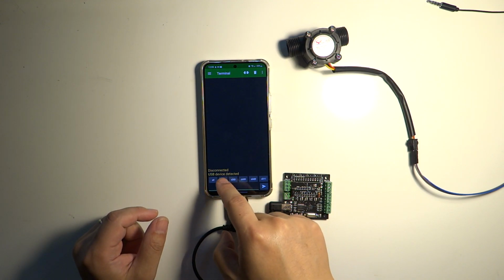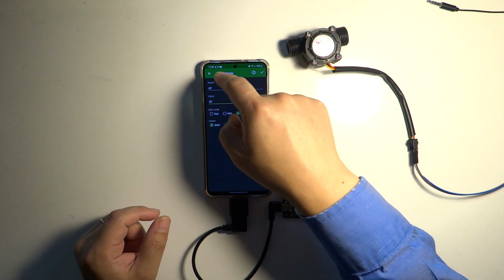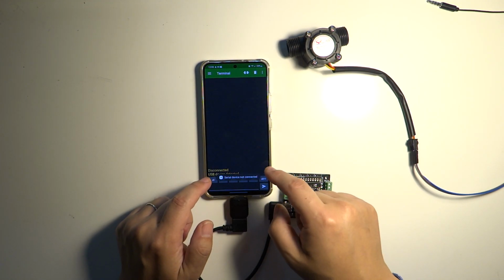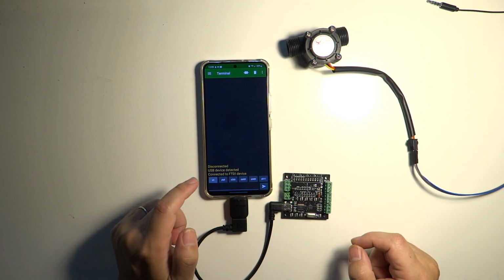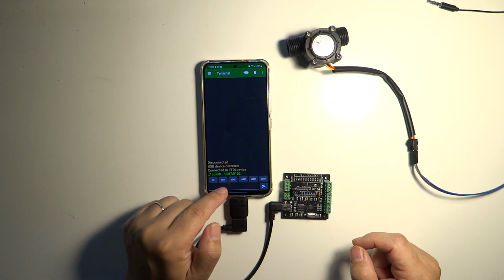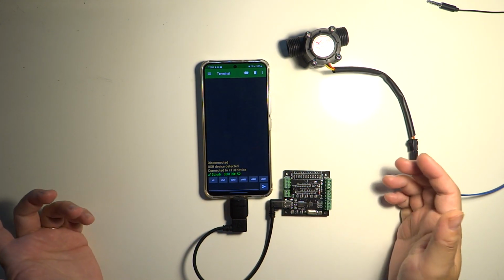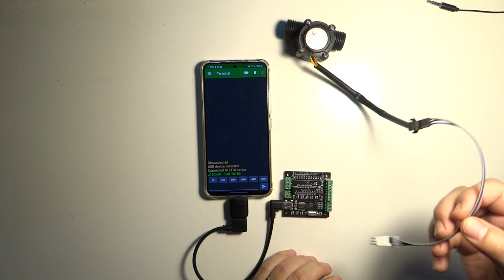For example, if I just long click, this says ZI exclamation sign. So this is asking for identification. So if I press, oops, all right, it's not connected. I got connect and press that. Okay, it identifies itself as the SDI adapter. So the TRD actually means translator. So now I have it, and I'll connect this.